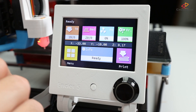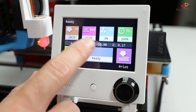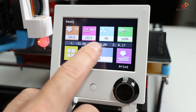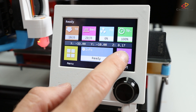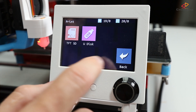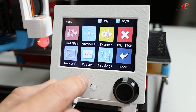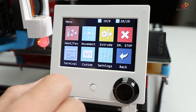If you've been using the previous design and firmware version, the new style will look different and has its own menu options organized a bit differently. On the start screen, all the important status information is now always visible — nozzle and bed temperature, fan speed, print speed, and extrusion factor. In the middle is the nozzle position and underneath is an info area where current status messages appear. In the lower right corner is the print menu where you can start a print from SD card or USB stick, and in the lower left corner are functions like temperature control, movement and homing, extrude, and more.